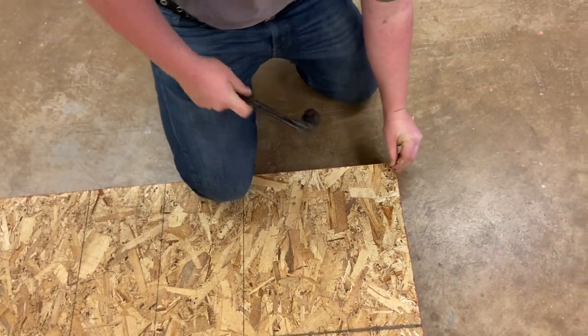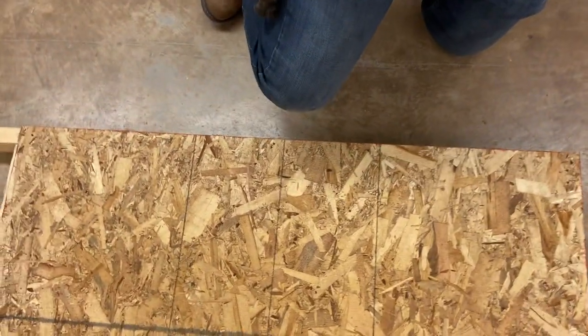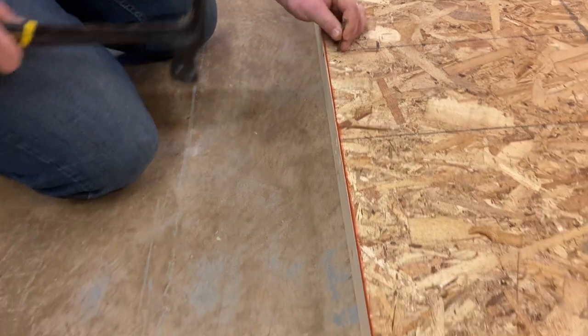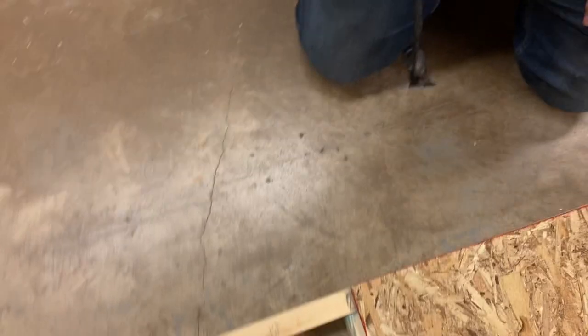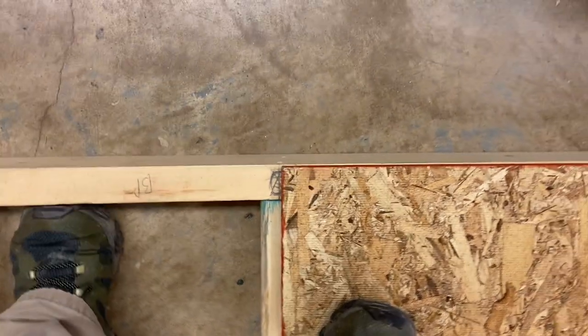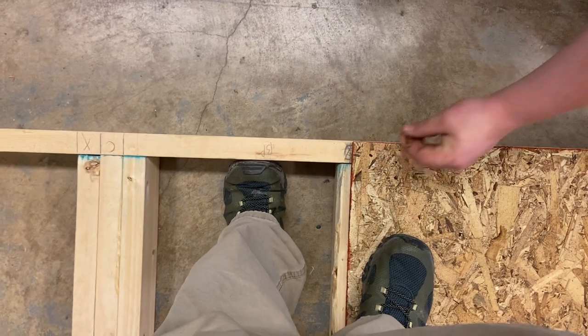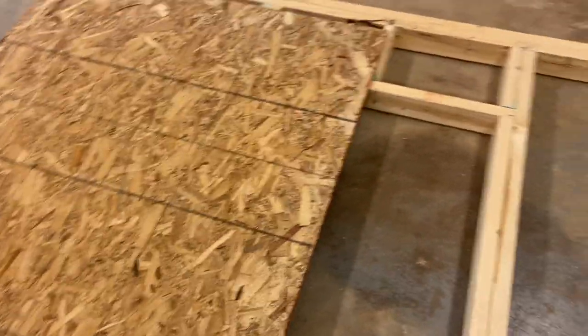Notice, we're starting at the bottom plate, working at the bottom. Now what he's going to do is come over here to about the middle. He wants to make sure that that reveal up off of the floor is totally even. Shane, get one right in the middle at about 2 feet right there because the reveal looks real good. Drive it straight in there, don't get it at an angle. He tacked it in. We get over to this side — it's actually hanging down on the bottom. This is why it's a two-person job. Just by me popping my foot down on that, I get the exact same reveal that I need. Shane, don't hit my toe, but nail me in in the corner right there. Our bottom is set, you guys.